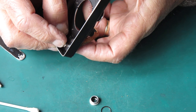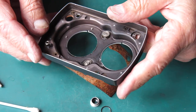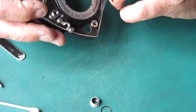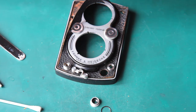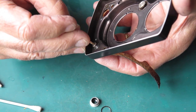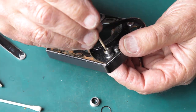I'll check the action of the shutter release — that's what I was more concerned with, because the shutter release needs to move smoothly. You don't want shutter releases that are stiff to release, otherwise you're not holding the camera as steady as you otherwise might. It needs to release with very light pressure. That looks pretty good anyway. I'm just going to clean out the hole in the middle of that shutter release, because that's where the pin goes — the pin that would be activated by your cable release.